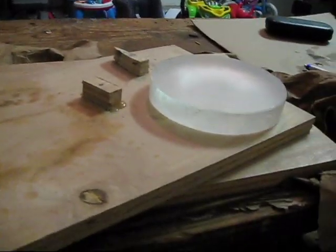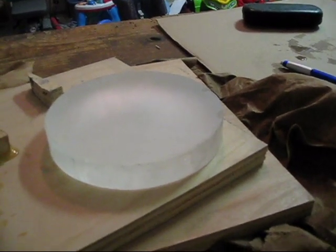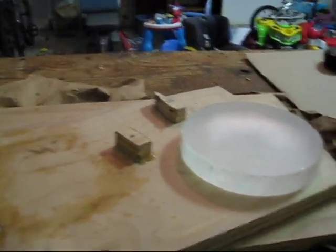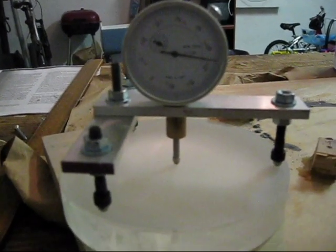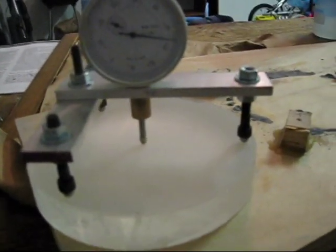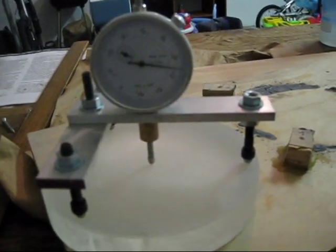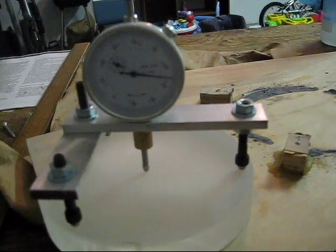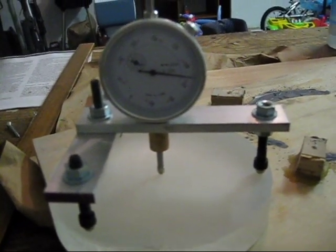Progress has been really slow with the tool on top. I'm going to keep going for maybe 30 more minutes. I managed to take the depth down one notch on the dial, and I realized what I was doing wrong — my strokes were too short. I wasn't going all the way to the edge of the mirror, so I wasn't eating into the outside of the glass. The spherometer was giving the same reading because I wasn't removing glass at the edge. After doing it correctly for about 25 minutes, I'm now back below my target depth.